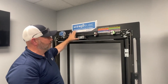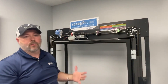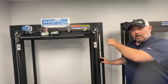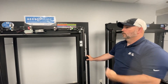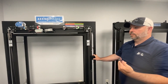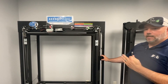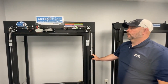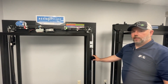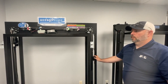Once that's completed — your outs are tight first, everything's sealing, slack's taken up out of your ends — you need to do a quick stretching process. Make sure there's no slack left in the system on that room. You're in the out position, remember your jack and your 2x4 underneath. Lower the room back down, then cycle and bump the room in about two inches or so, back out, back in, back out — three times. Now do one full cycle all the way in. Once that room's all the way in, do the same thing: in and out three cycles, and then all the way back out. The whole time, you're watching these brackets — make sure they're not catching and colliding with one another.